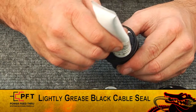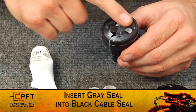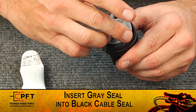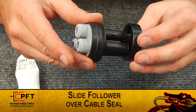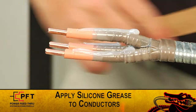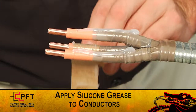Take the black cable seal and lightly grease its face. Then insert the flat side of the gray secondary seal into the recess of the black cable seal. Now, hold up the black and gray cable seal assembly and slide the follower over the 3 legs of the cable seal. Spread the 3 conductors apart and apply a light coat of the provided silicone grease on each one.